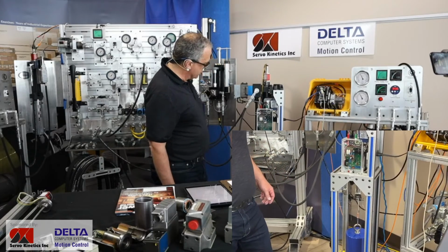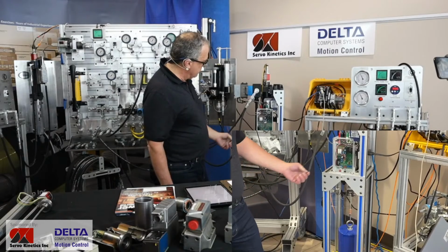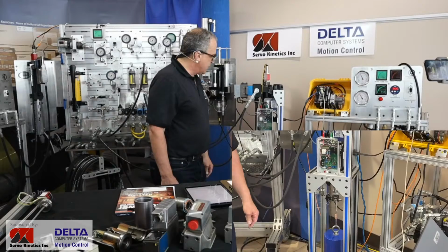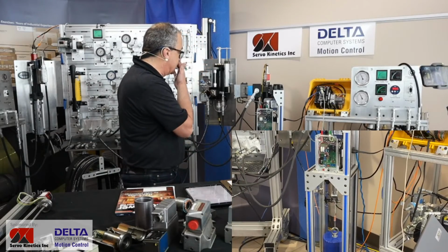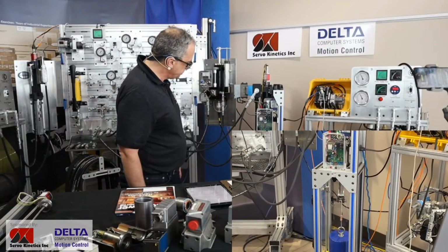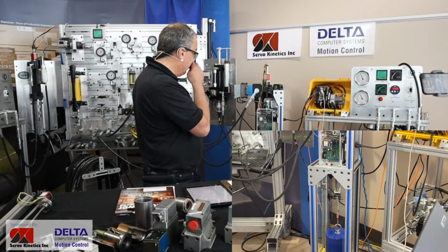And so maybe that's not as much fun as the positioning we could get into, as if, say, we move that potentiometer to about 10:30. Okay, so if 12 o'clock is 6 inches of stroke, then about 10:30 on our potentiometer should be about 3 inches of extension on that rod, and that's what it is.